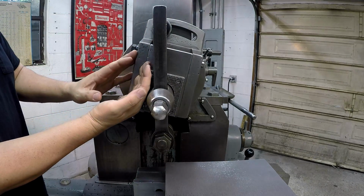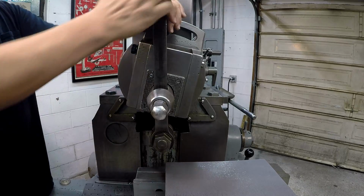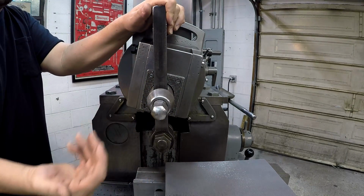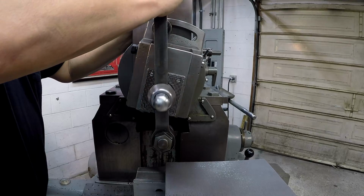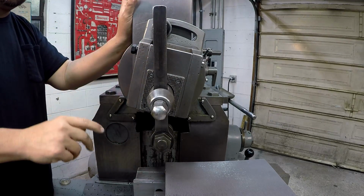So if you had this clapper swung this way, in the direction of the feed that I'm normally doing, whenever you go back like that, it's going to bring your tool over into the material that you haven't cut yet. So that's why the clapper is swung that way, because of the arc. It's swinging out and that way, in that direction, away from your material.